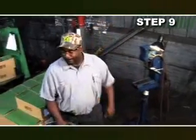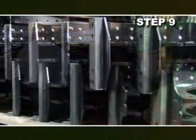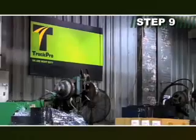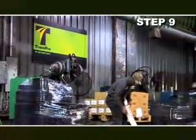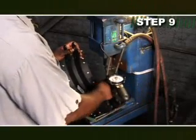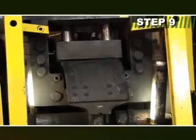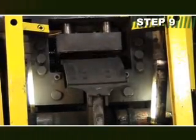In the rare event that the last shoe is not within the correct specifications, the entire pallet is rejected and the rivet machine is shut down for inspection and correction. The rejected pallet is then individually torque tested, and all shoes that do not meet specifications are removed from the process and sent back to the de-riveting phase.